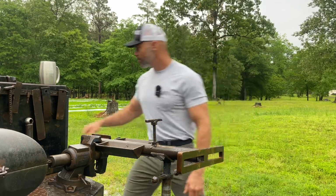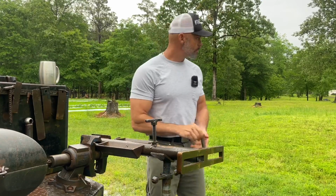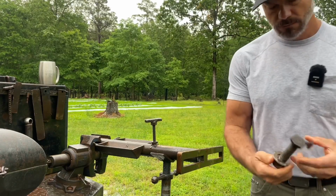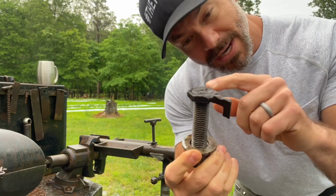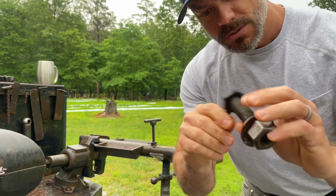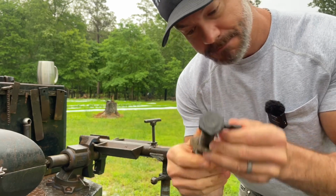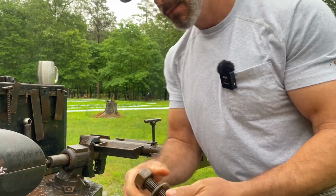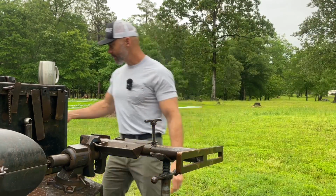I'm going to show you the bolts real quick. This is for the smaller stuff. I cut that bolt, I welded that bolt on, I cut it in 2 and then I welded it on there, and I put this little tab on there so when you jam it in the flange, it'll hit the side of the flange, you don't have to hold back up. It's real simple stuff. It's got a washer on it because these slots are huge for those big fittings.